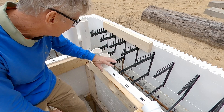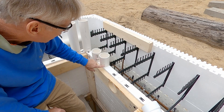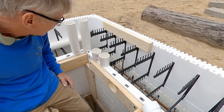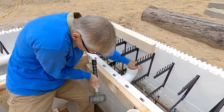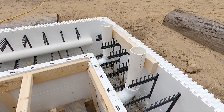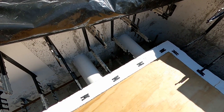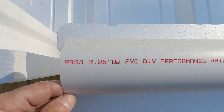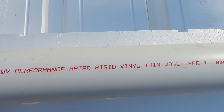I'm getting ready to assemble the air vents on the north wall. I got all my pieces cut and ready to go — notice how I have marks to show how much penetration into the coupling so I know I'm about where I need to be, it's not just guesswork. This is schedule 30, which is three and a quarter inch outside diameter thin-wall drain pipe.